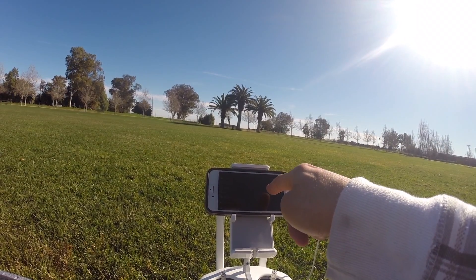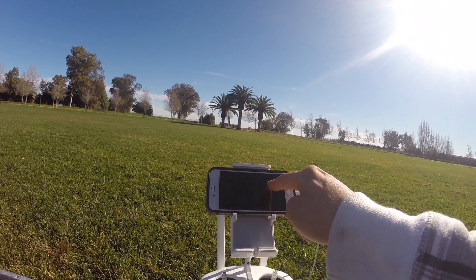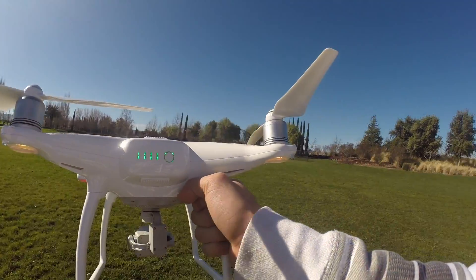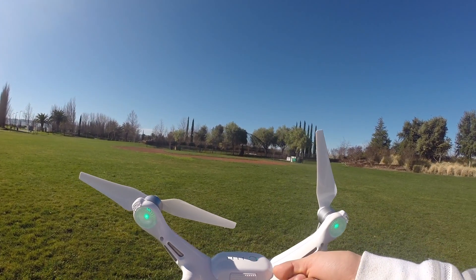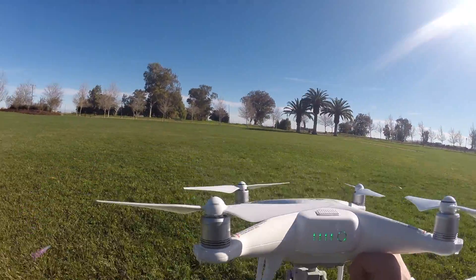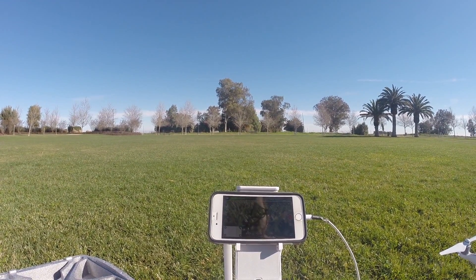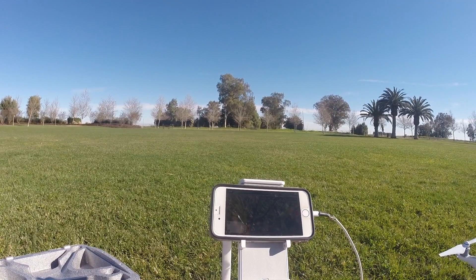To start the calibration, on top of the app where it shows you the camera preview, go to the top left hand side next to the DJI logo, tap that, and when it turns green hit Compass — you'll see the calibration option right there. When the lights are yellow, hold the drone from its landing gear and rotate 360 degrees. Once the lights turn green it's complete. Then face it downwards and repeat the process until it turns green and starts blinking — that means you're good and the compass is recalibrated. Make sure it's on an even floor level. When you first start out you'll be in Beginner Mode — fly around, get a better feel for the drone, and later you can move to Sport Mode.